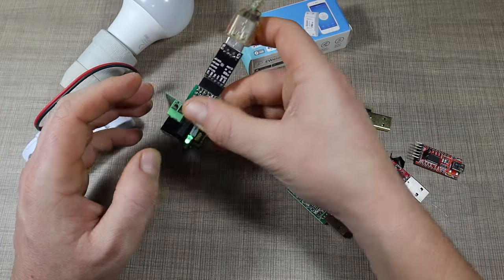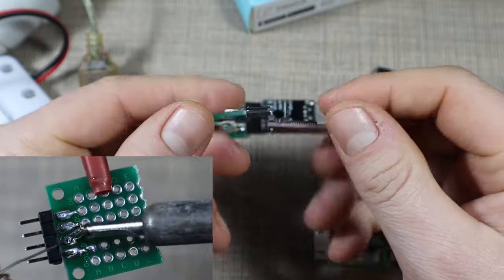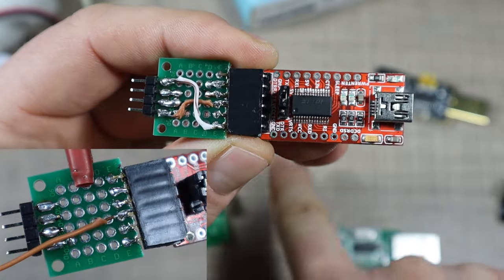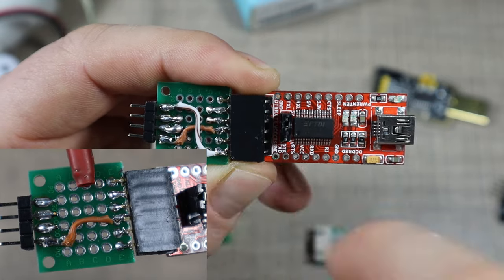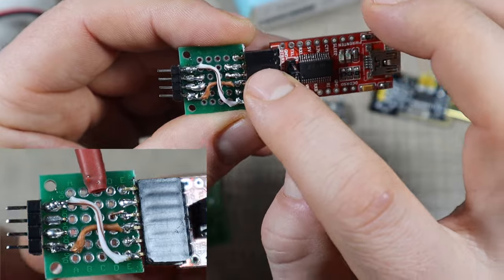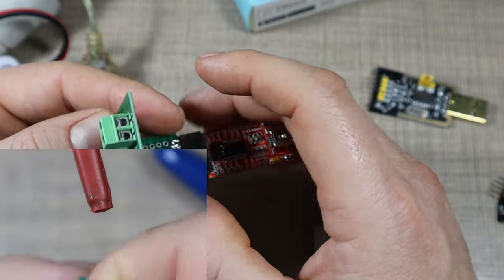Here I have a USB lead coming in from my computer — the device is being powered up. I also made another adapter for this other USB-to-serial, the FTDI FT232RL, another popular USB-to-serial board you can use to program the Sonoff switches. The layout here is quite different — we have the ground pin on the far bottom where we had 5 volts. The ground wire goes to the end pin, power comes from VCC, and it's important to have the jumper set at 3.3 volts so we don't overpower the Sonoff switch. TX and RX again wire from the bottom to the middle two pins, providing the right connection so we can align the pins and plug it into the computer.